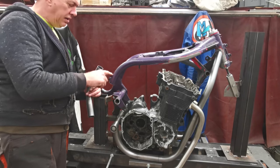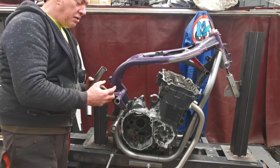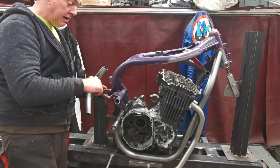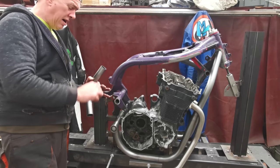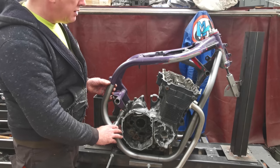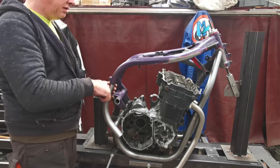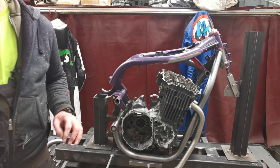From my understanding, this is from where you're welding, obviously you're heating it all up. So the air that's inside it, the pressure is going to increase because that's related to temperature. And this just gives the expanding gases somewhere to go. So that's why there's little holes in there. But I can plug that up, that'll be fine. That'll be absolutely fine. And when I'm welding this to that, there's going to be a cross hole here and everything else, so the air will have somewhere to go. Right, let's dress him up.